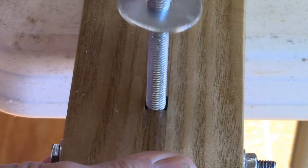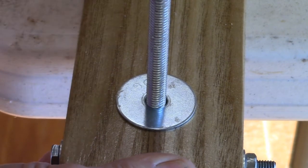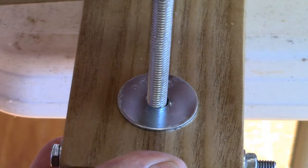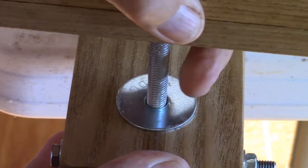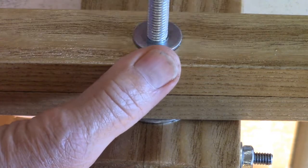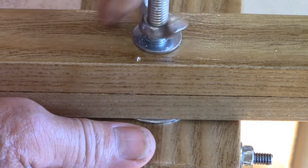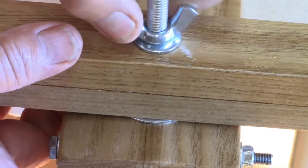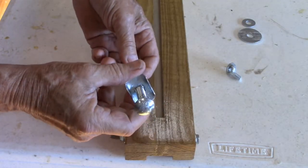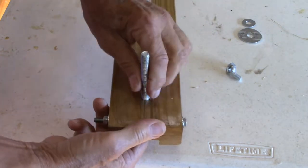This is the end point. We put this washer in — this washer does a couple of things: it allows pivoting without dragging on the top surface, and also I'm going to put my adhesive tape measure on here. This will allow clearance to swing across the tape and not drag. You can see it's a snug fit, and we apply our three-eighth wing nut. This allows us to secure it in either position. Here's our three-eighth carriage bolt with the modified washer — we apply that into our channel.